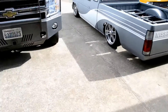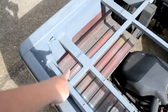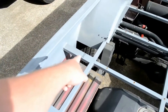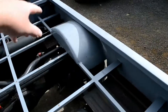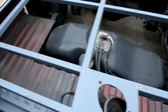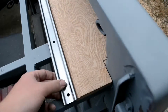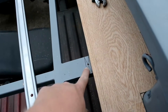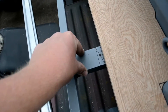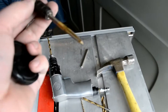All right, it is now Tuesday. Out here I can get more done. So far, got my positions marked where I need more of the rivet nuts to finish up the side panels. Holes are drilled, about ready to start this side. It's rough cut, so it's a little long. Opted out to tap the holes in this C channel, because it's quite thick and I don't even want to attempt to put a rivet nut in it. So just cut out the quarter-twenty.